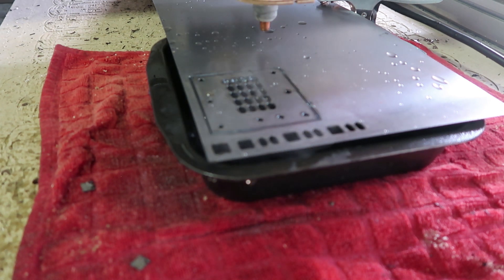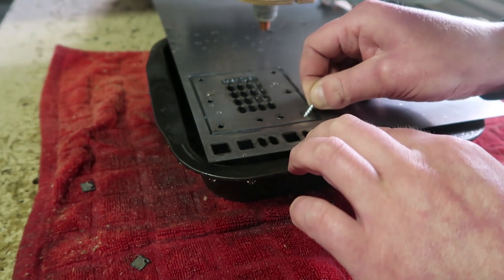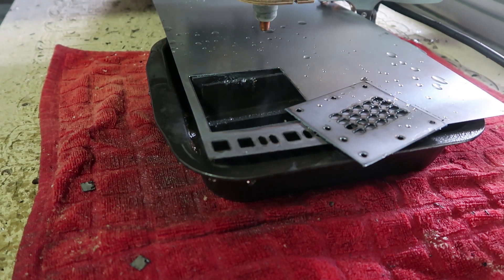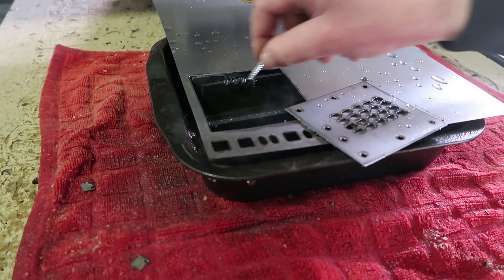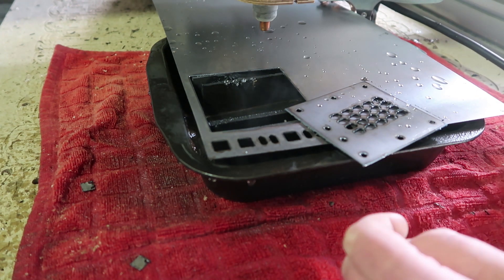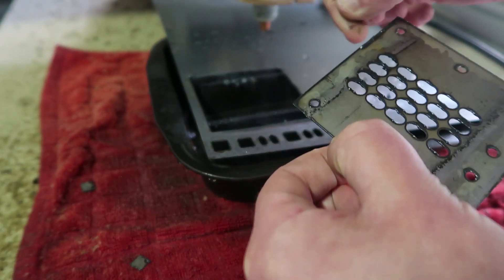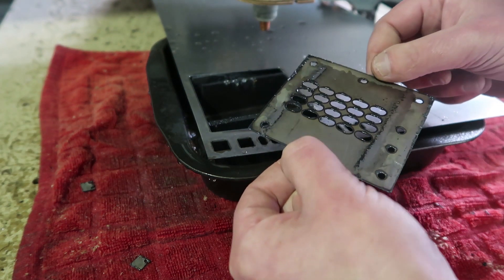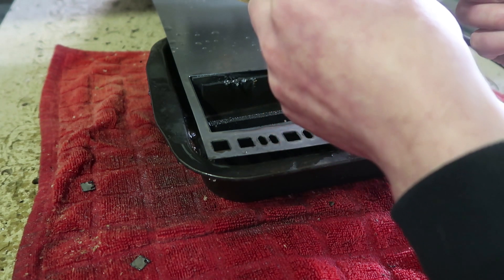So what do we learn from this, besides I might need more water in there? A few did not cut — I wonder why. Oh, it did cut, it was just resting on a piece of steel. It does make the cut look bad, which I was afraid of. This piece here has crap on it. Everywhere it touches the support, it becomes uglier than it should be.